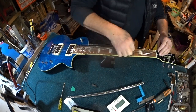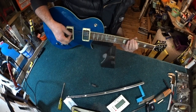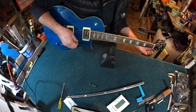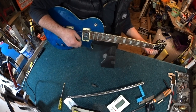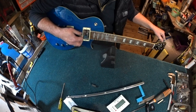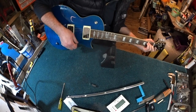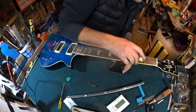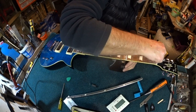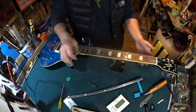It ain't true. Right, just make sure this E string now plays. We've got the basic precision part of the setup done. Now this at the moment is sitting very low as it settles in. So I'm going to bring this back up a little bit on the high E, and then turn a bit on the low E, and we're good. That can stay where it is.